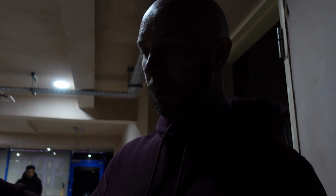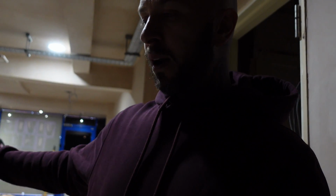There was a bit of a slope down here beforehand where the ground was a little bit uneven and it kind of fell away, so we were thinking we might need to use an LVT, which is a luxury vinyl tile. Yeah, an LVT flooring, which you glue onto the actual floor rather than it being like a material. It's really thin and quite pliable, but I don't think we're going to need it. We can kind of see where we're at, and I think we can do it with a self level. We don't have to go and find a specialised floor. We can just use what we always use and really like.